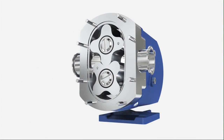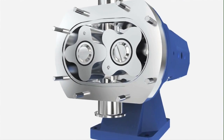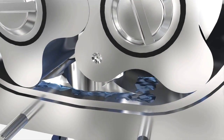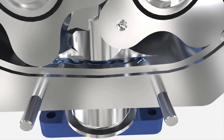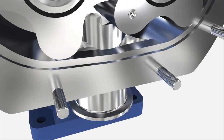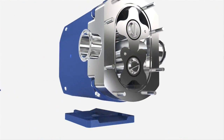Universal mounting gives complete installation flexibility throughout the plant. By setting back the cusps and incorporating a 3 degree fall angle, the pump can be completely drained while retaining pump efficiency. This provides increased product recovery and also ensures the elimination of any condensate trap during sterilization.